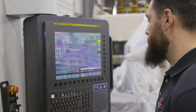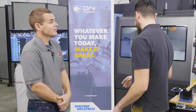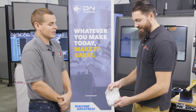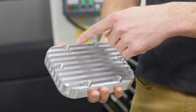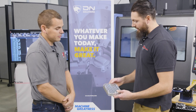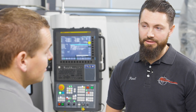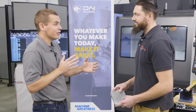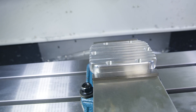Simco Probing is really nice — within Mastercam it has a lot of nice visual graphics so you can see what you're doing. The simulation side of it is really powerful. For example, I have this part right here — the PTO cover. I actually wrote an inspection routine to measure these different bores and get the size. As you can see, it's not a complete bore. So I used the 3-point method and was able to set the vectors within Mastercam and visually see it before I ran it. Being able to do that visually with an interface inside of Mastercam and get that positioned right with that 3-point circle — that's a super powerful advantage.